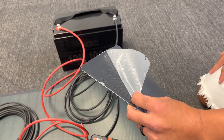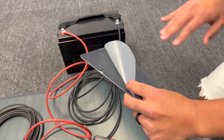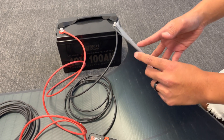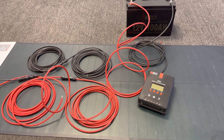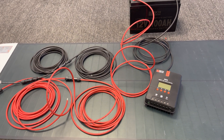The sticky portion will go onto pretty much any outdoor surface you want to use. Just make sure you clean the surface in order for the adhesive to stay on. That's the simple setup for a 160-watt flexible outdoor solar panel. If you have any questions, please feel free to give us a call.